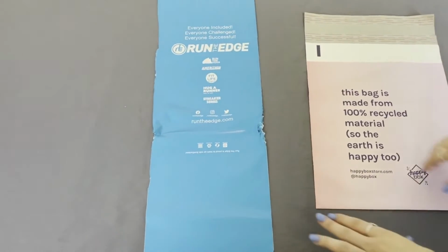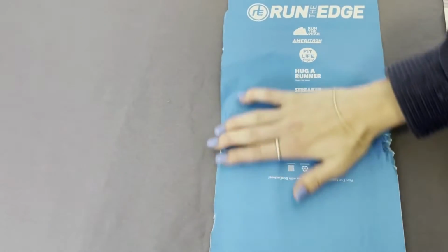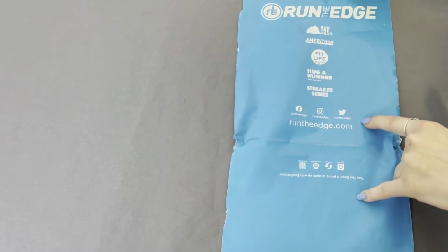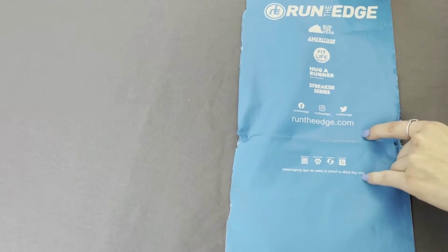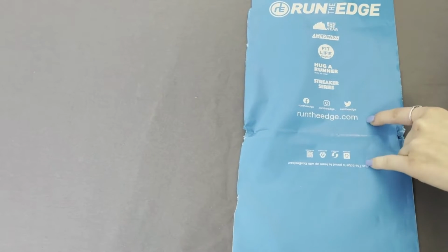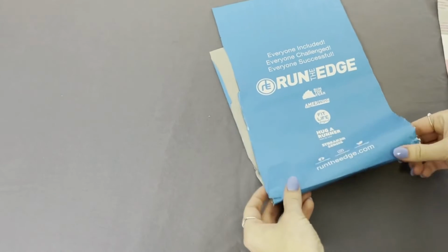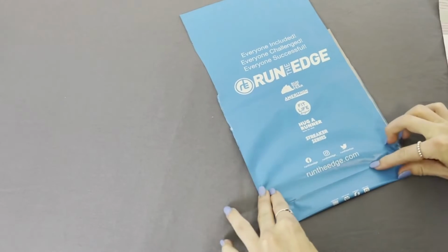And so the first one we always like to call out is this edge right here. As this is printed fully flat, this verbiage can move a very, very small amount, and that's just based on the print tolerance. Often we see it's between 1/4 of an inch and 1/2 an inch at its very furthest possible amount. And so if this verbiage is moving at all like this, and then when it's converted and folded there is a tolerance and it ends up like this, that is not ideal. That's not what we want.